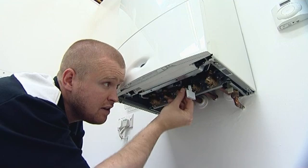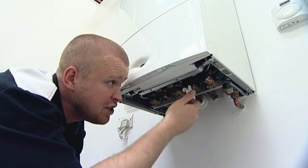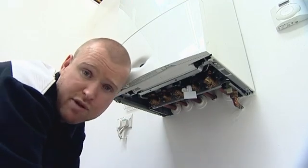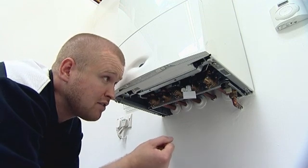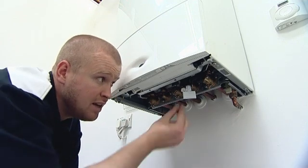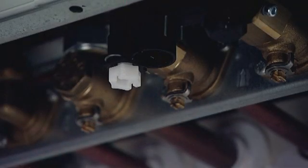So what I'm now going to do is begin to tighten this plastic spindle knob back up until I can actually hear the water stop. I'm then going to turn the key back to the open padlock position and remove the key. Before I remove the key, there's a chance there's going to be a little bit of water that comes out — that's fine. If you've got a bit of paper or rag to mop that up, that's fine. However, if the water continues to come out, do make sure that this spindle knob has been tightened up properly. So I'm now going to remove the key, and as you can see, just a few drips of water.